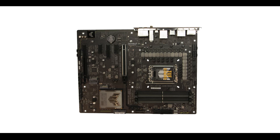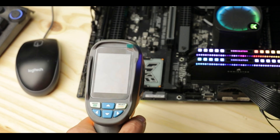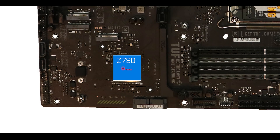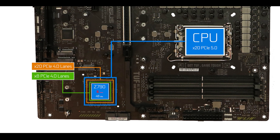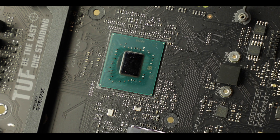Chipset-wise, the board is powered by Intel's latest Z790 chipset, which runs at a very cool 6 watts, keeping it cold even with a somewhat reduced heat shield. The bandwidth menu is very similar to its predecessor, the Z690. Most novelties this year come from the 13th-generation Intel processors providing 20 PCIe 5.0 lanes — which were very poorly utilized on this board.